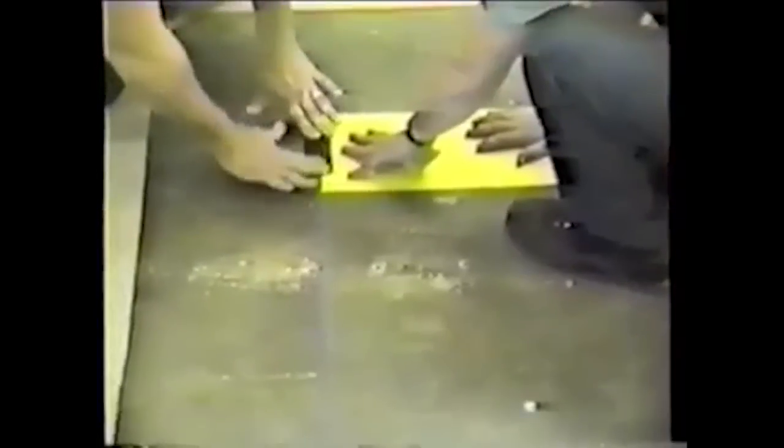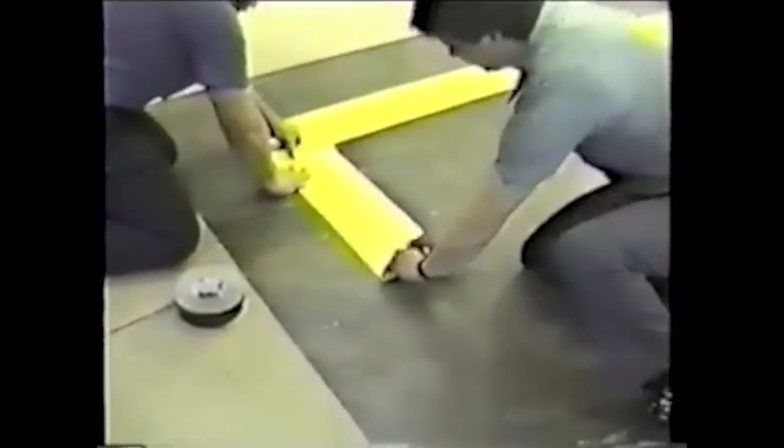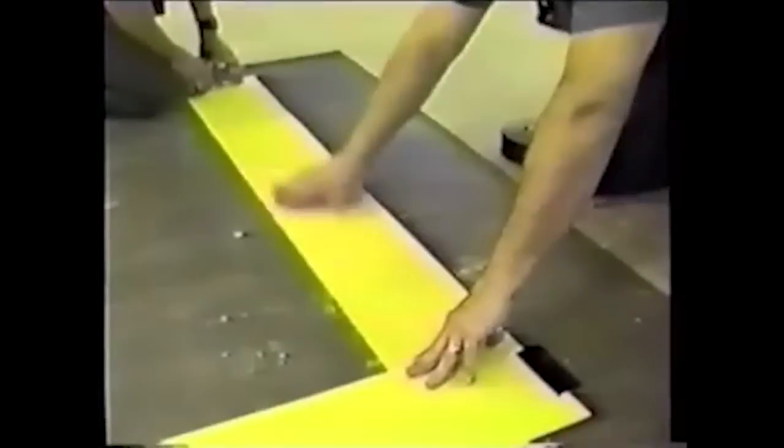All installed floor preparation should be taped with hold-down tape along the edges of the complete installation at 10 to 12-foot intervals to prevent the floor preparation from shifting. Floor preparation should never be cross-taped or cut during the installation of floor fittings.